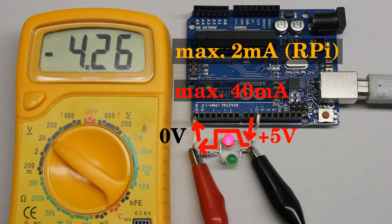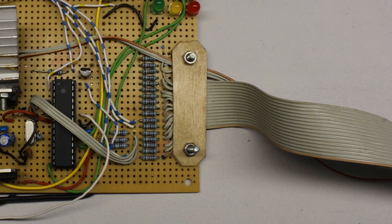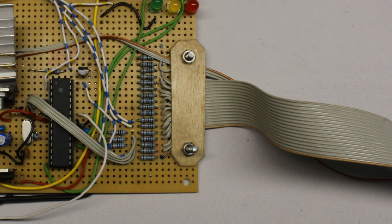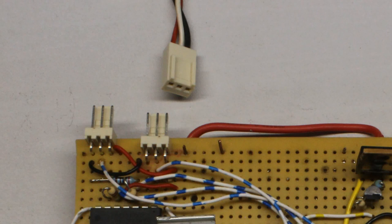The type of wiring used in this video is clear, but due to the many bare cables there is a high danger of shorting a circuit. In practice you should solder all devices on a board or use a breadboard for experimental circuits. Use kink protections for cabling running to your board, and ribbon cable connectors instead of single cables. Whenever detachable connections are needed, use jacks with a reverse polarity protection.